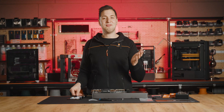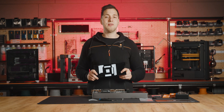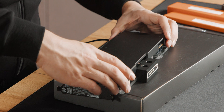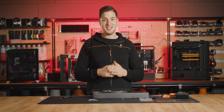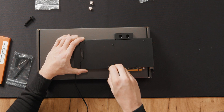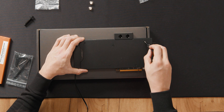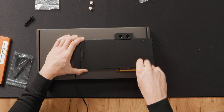Step 9: The final step is to position the back plate, including the screws and standoffs, onto the GPU's PCB. Once all the holes are aligned, tighten the screws evenly — half a turn here, half a turn here, half a turn here, two turns here, three turns here — working in a balanced pattern around the board.